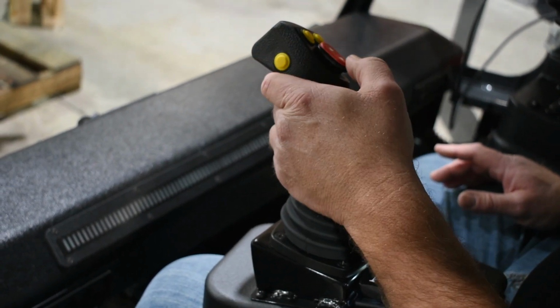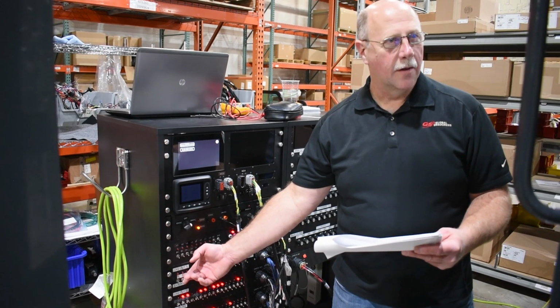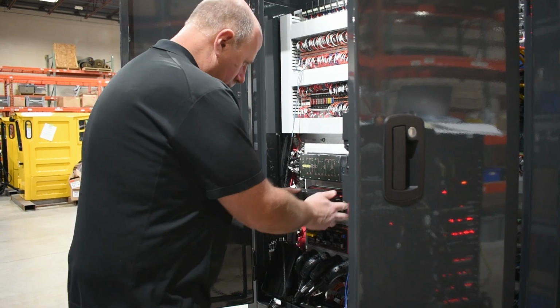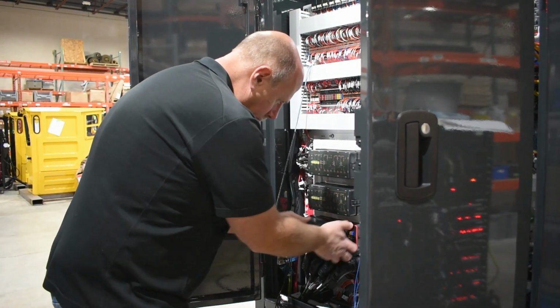They're modular, so we can configure them easily using standard modules so that we can test different cabs or use the same test stand to test many different cabs. And they have dual voltage power supplies. It can be 12 or 24 volts, and they're protected against short circuits and overload. So if something's wired wrong on the cab, that prevents damage to components or wiring.